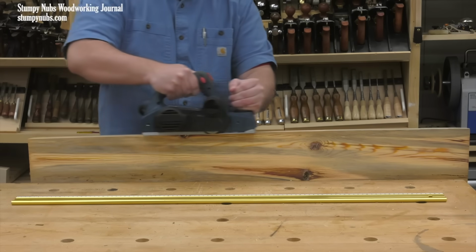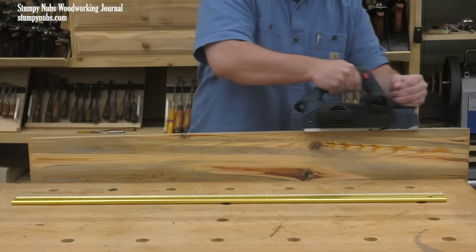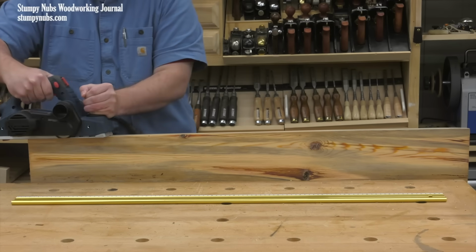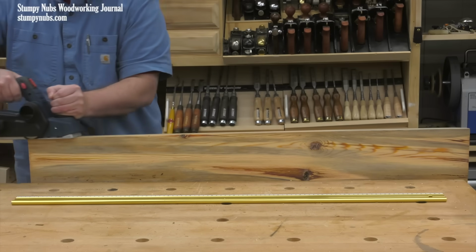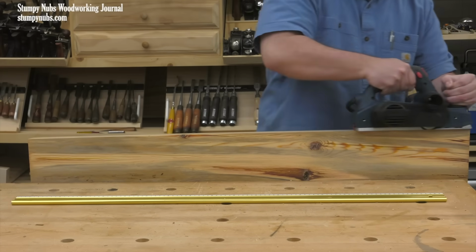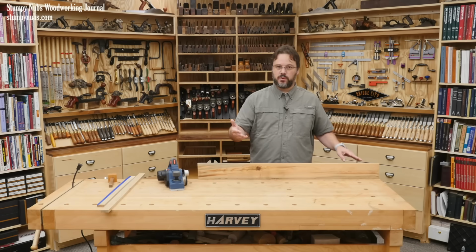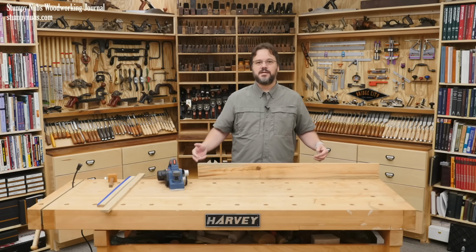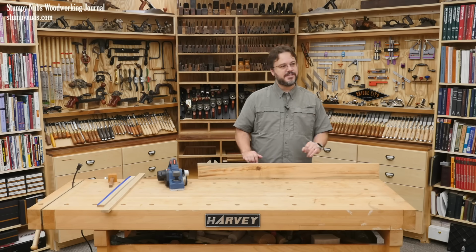Begin with one very shallow short pass in the center of the edge. Then make a slightly longer one, and so on until the final pass covers the entire length of the edge from end to end. Because you did more planing at the center of this edge, the board should be straighter than before. If more work is needed, then you just repeat the process. You layer your passes and feather the edge until the crown is gone and you can safely rip the board